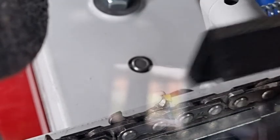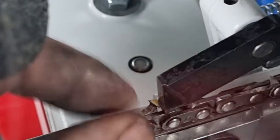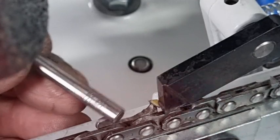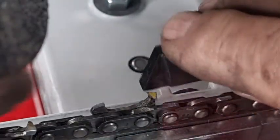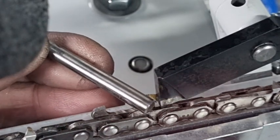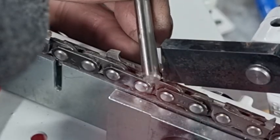We've got another one here that's a little bit different — it's been ground down to about four millimeters with a slightly different length. I've made them all different lengths just to see whether having different lengths means they come in on different angles. This one hasn't got as good clearance either, and I'll just make sure it's sitting properly. If I can come up with a much better pawl... This one here has a little bit of clearance too, but there's not much in it — probably just over half a millimeter. You can get away with this one as well.